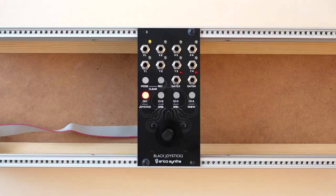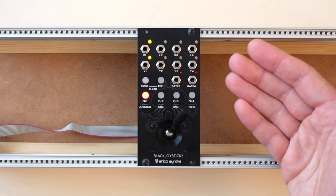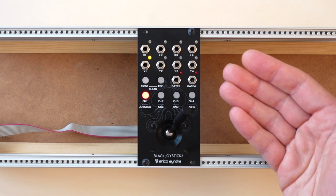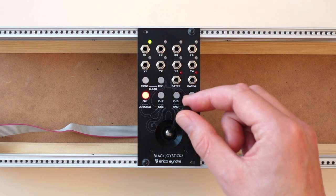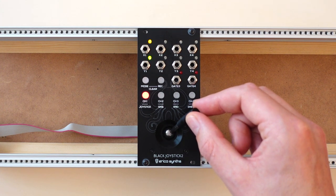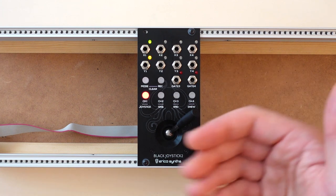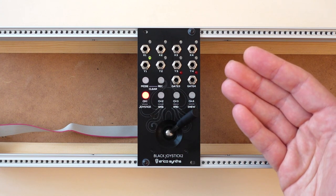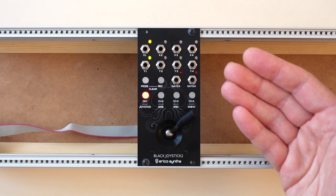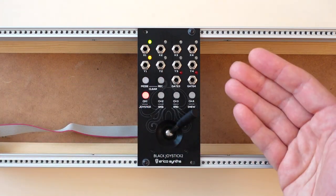In random mode, a channel becomes a step random voltage generator. The X and Y outputs each generate a unique random voltage, and again, with the joystick, you can control both the frequency and amplitude of the signal. Using audio rates in this mode leads to a variety of noise, from white noise to a slow, glitchy, gritty noise. These can be used as audio source or as a modulation source to create texture and grit. And again, you can record and loop joystick movement.